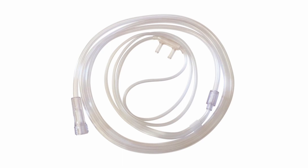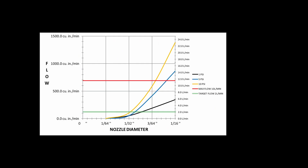There are a few things to think over before you get started. The first that occurred to me was how to measure flow. Using this graph of CFM versus nozzle size, I've plotted several traces at different PSI that will at least get you in the ballpark. In my case, I run the line pressure just about as low as the regulator will go. With the needle sitting almost on zero, I can still hear the flow, so I guess that I'm running about 1 PSI. Since my nozzle size is about 50 thousandths, or just over 3/64ths, which I found by measuring a tip cleaner, if I enter the chart just above 3/64ths and go up to the 1 PSI line, then across to the cubic inches per minute or the other way to the liters per minute, I see that the flow will be about 200 cubic inches per minute or close to 4 liters per minute, which is above my target flow of 2 liters per minute.